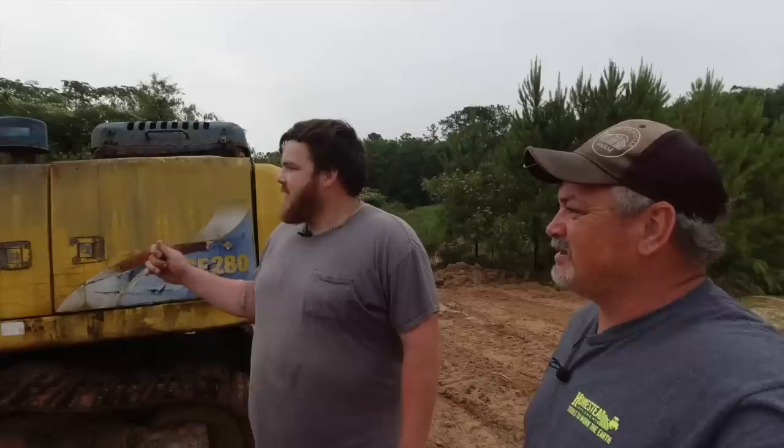All right, Biggin. So walk us through what's happened since we've actually started this thing. Okay. Well, I came back out here this afternoon and got in contact with the owner, and he was so excited we got it running, and he obviously wants it fixed. Sure. At all costs. Okay, good. So I came back out here. I found that the strainer was full in the tank. The return side strainer was full. So I got that cleaned out. We got it moving some. It is still going to need a hydraulic pump, the main tandem pump.